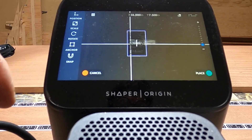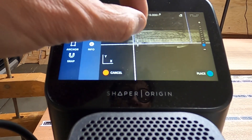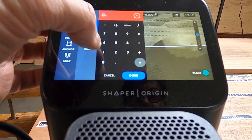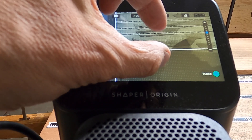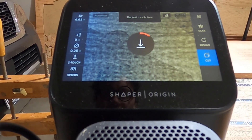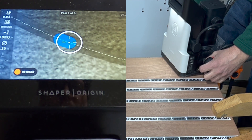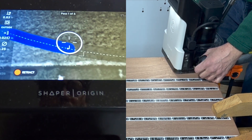Next I position and place the design such that the desired part is within the cutting surface. Now we're ready to cut. I complete the z-touch with my quarter inch by one inch long bit. The cutting process is the same as we used with the plywood, only we'll use five passes to cut through the 7 eighths inch Sapelli hardwood.